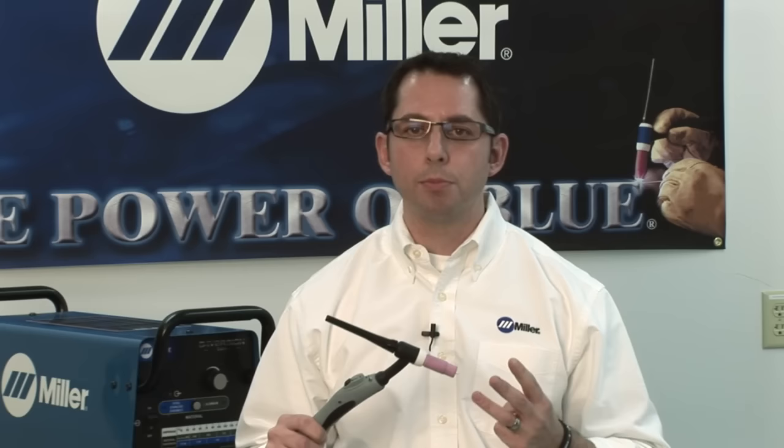The first topic we wanted to cover is proper torch angles. The first thing I usually tell people that have issues with the TIG welding process at most of these shows is if you just keep three simple things in mind with the TIG process, it'll probably solve a good 80 to 90% of your application issues that come up. It really boils down to the angle of your torch, the angle of your filler material as you're adding it into your molten puddle, and just keeping in mind that the torch melts the base material and the molten base material melts your filler rod.